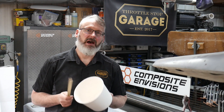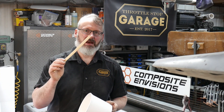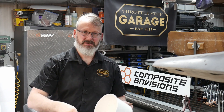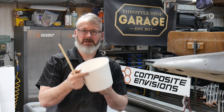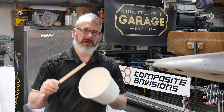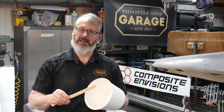Two of the most useful things I've found for mixing epoxies are these large white paper buckets — they're a double-walled bucket — as well as the bamboo stir stick. The bamboo stir stick is important: it's straight, it's got rounded corners, and it's used to carefully scrape down the sides of the bucket so that none of the resin or hardener you've added remains unmixed. Thoroughly mixing epoxies is extremely important — they're thick materials and they do not mix very easily.